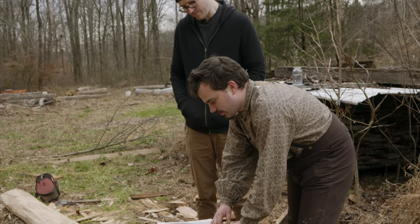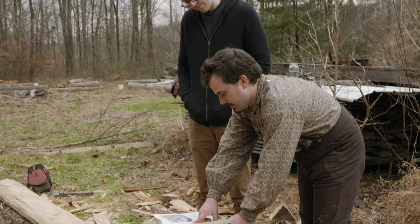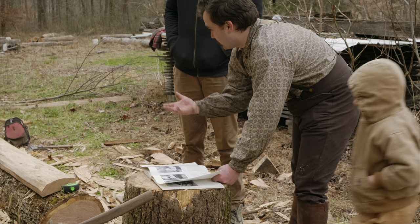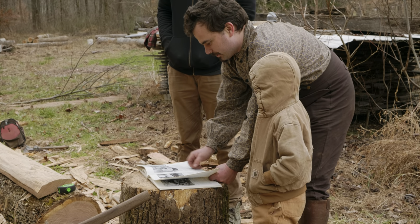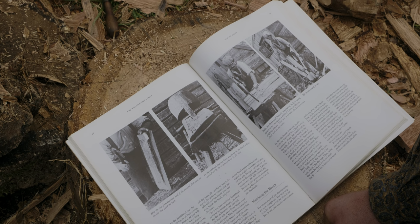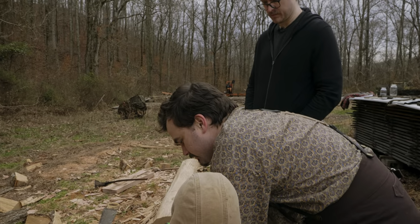All right. So if the plank comes out twisted, this is what he says to do. Basically, you make the riser, which is the piece that angles upward here, out of the matching piece. Yeah. And basically it levels out in the middle of the bench. Okay. Which if that piece is made out of the piece that you split off of this piece, the twist will match pretty well. Alrighty. But we've got a nice flat bench now, and I'm working on the riser right now.